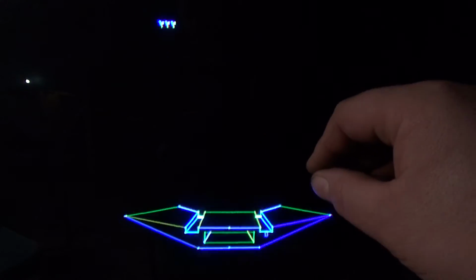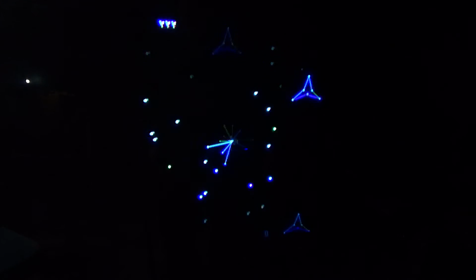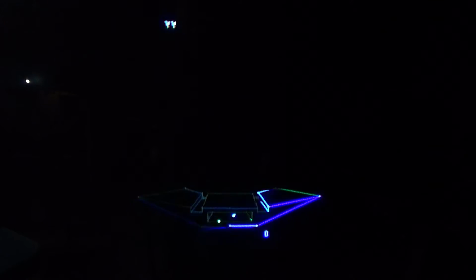Also, you notice the picture is larger. It's about 50% of the screen right now. So, you know what? I think I'm going to change the capacitor sizes on the VECTREX board to enlarge the picture the rest of the way. I could squeeze maybe another 10% out of this monitor, but I'd rather just increase the signal output on the VECTREX itself for the rest. But yeah, I'm gonna call it.